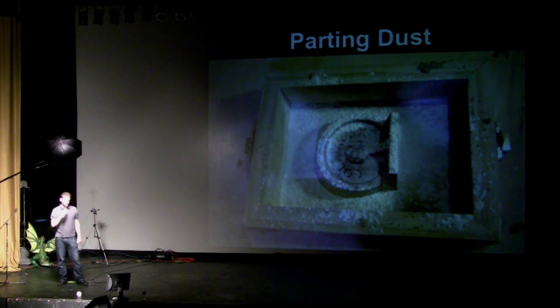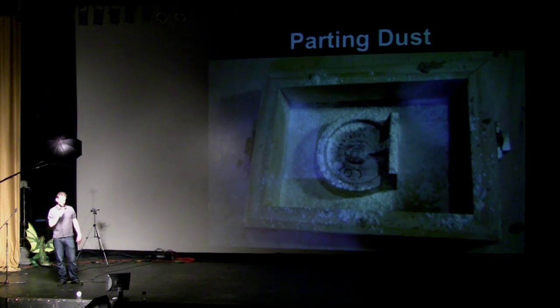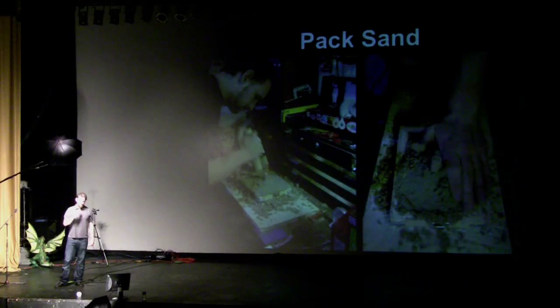So let's do it. Put the cope down — one of those two wooden frames — put it down and apply parting dust, which is talcum powder, baby Gold Bond. Smells great. It keeps the sand from sticking.